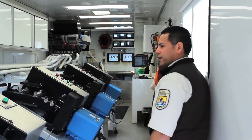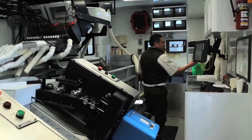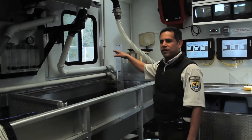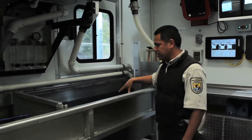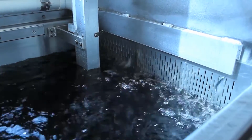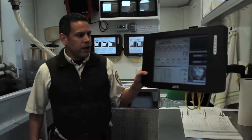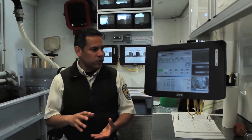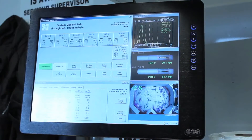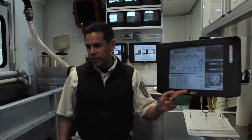Let's go to the front of the trailer where I'll show you how this process works. Up here is where everything's controlled and the process begins. Fish are brought into this fish loading door here and dropped into this trough, which is a holding tank for fish. At the bottom of this trough is a fish valve, and that valve is controlled by a computer system here. This system will tell that valve when to open and close. It works on a contrast between white and black, and we can adjust the number of fish that are sucked up into the sorter system through this computer.